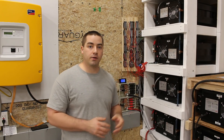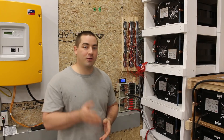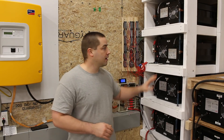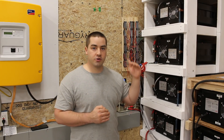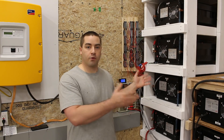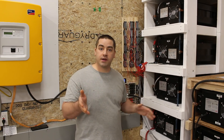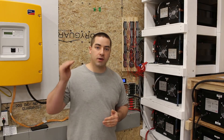My conditioning process is probably going to take two or three weeks to fully condition the packs to the point where I'm happy and will put them into full service. Until then I'm not going to pull big amps out of these — I want to wake them up very gently. Now, lithium iron phosphate has a very flat voltage curve. My intention is to use these from roughly 20% state of charge up to about 95%, which I think will translate to 48 volts up to 56 volts. These are 16 cells in series — 16S — so please let me know in the comments if those voltage numbers correctly translate to that state-of-charge range.